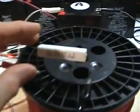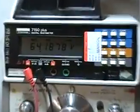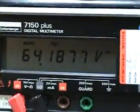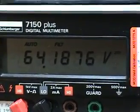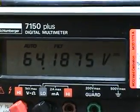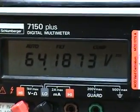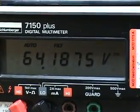Right now what I have is my batteries powering this 22-ohm resistor directly, but it's still being pulsed — that 22-ohm is being pulsed by the 555 timer. I've adjusted the pot so that my voltage right now with that load operating is at 64.1875, and it's staying very, very stable.